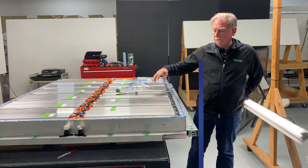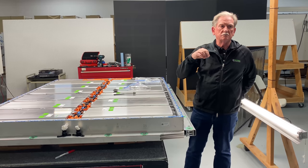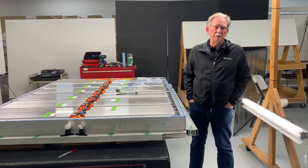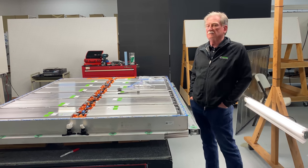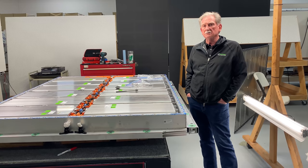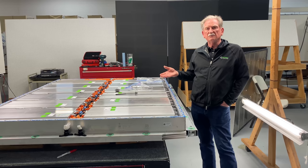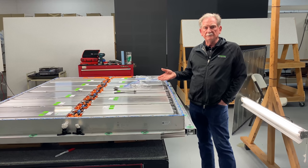So if Sabeck could take this battery pack and make it equivalent to the Tesla Model Y battery pack, you're looking at a 50 kilogram reduction in weight. In general, people say that for a kilogram of weight reduction in an electric vehicle you're looking at about $10 — that's $10 per kilogram, and a kilogram is 2.2 pounds. That means if I can reduce this by 50 kilograms, that's $500 in savings. That's quite a bit — that's a lot.